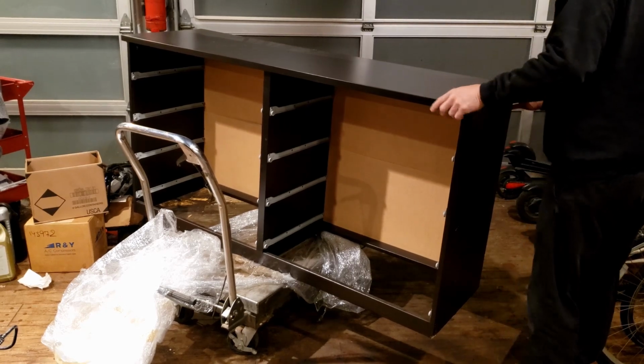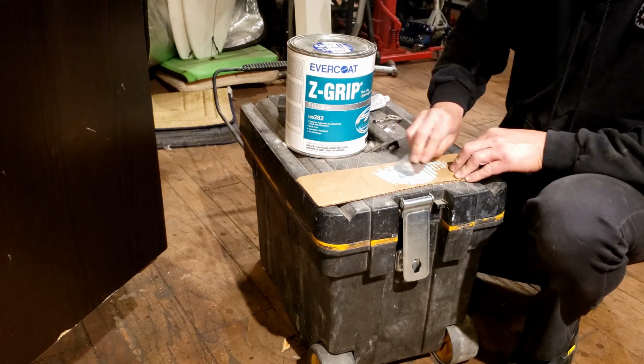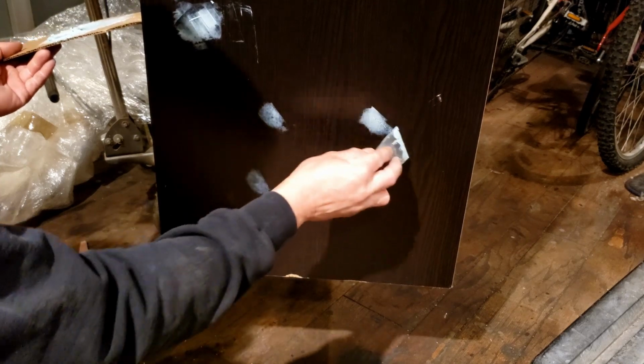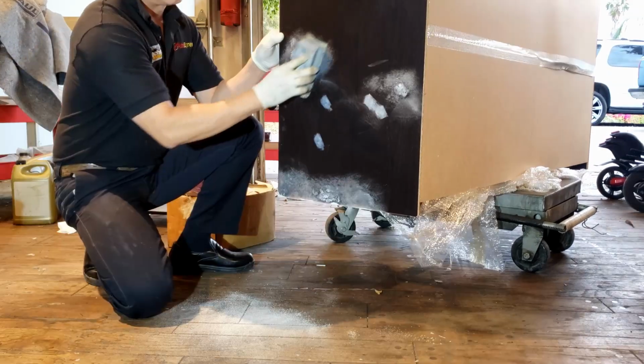So we've done the 3 steps on the drawer faces. Let's do the 3 steps again on the dresser cabinet. Well, first I'm going to use some body filler to fix these scratches. If you need to fill in deep scratches, my favorite thing to use is auto body filler. It doesn't matter what brand. Bondo brand filler is most common and most hardware stores carry it, again in the paint department. It's not just for metal body panels, it works really well on wood.